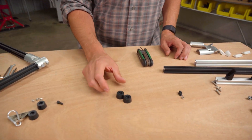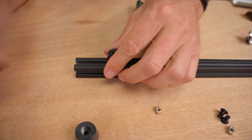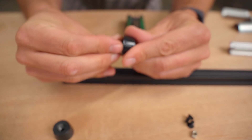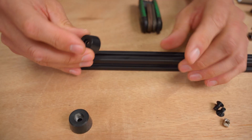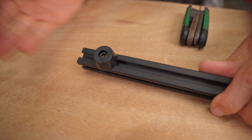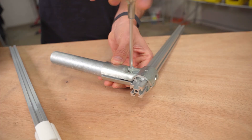Lastly, we've got a molded rubber foot. Using the same technique — get the bolt in there, put the T-nut on, drop it in place, tighten it down — and you've got a floor-safe rubber foot anywhere along the extruded aluminum. I hope that piqued your interest and gave you some ideas. The best part is that this ecosystem is already developed; you can pick out these solutions and use them for your next build, whether you're using just extruded aluminum or pairing it with your EMT conduit builds. If you liked one of these and think it'd be useful, leave a comment below, consider subscribing, and we'll see you in the next one.